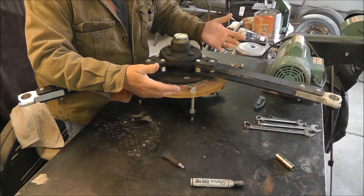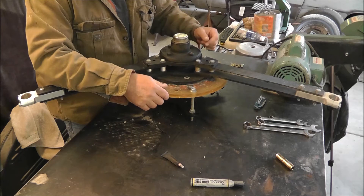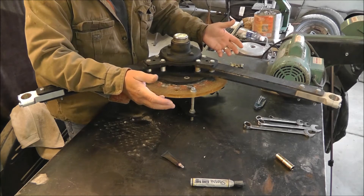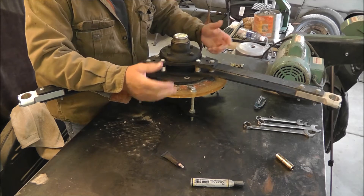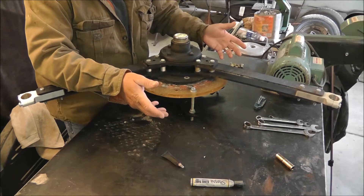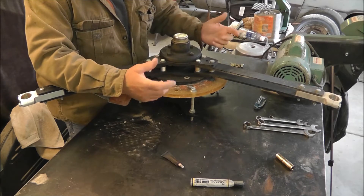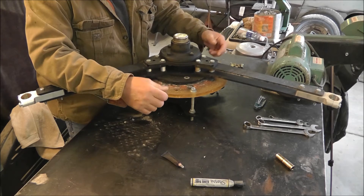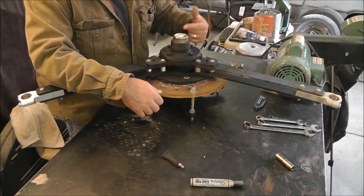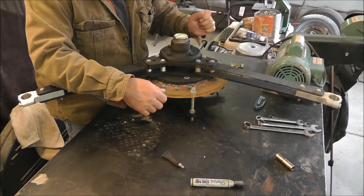So I took the grease out of here because there's no lateral load on this — it's not holding any weight other than its own weight. I was going to use way oil. If you're a machinist, you know what way oil is — it's oil you put on the ways of your lathe and mill. Way oil sticks to whatever you put it on and doesn't drip off like regular motor oil, but it has the viscosity of regular motor oil. I didn't have any way oil and I live out in BFE — Pahrump, Nevada — so way oil isn't readily available here, so I just used motor oil. I think part of the problem is that I used motor oil.